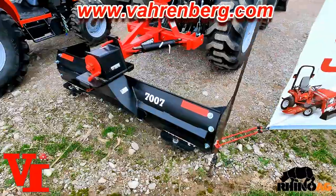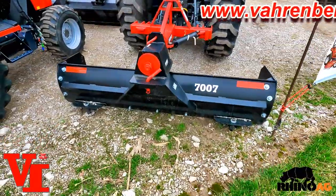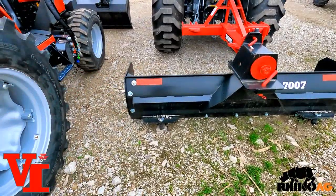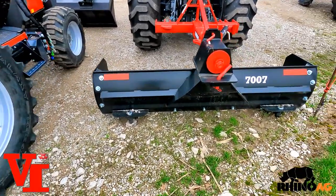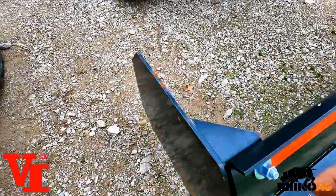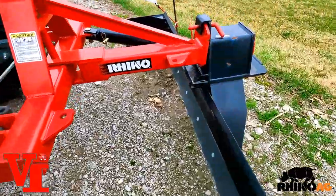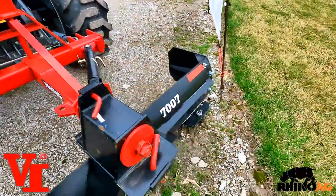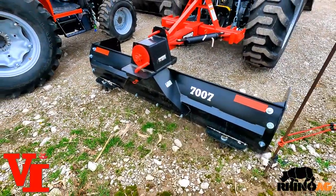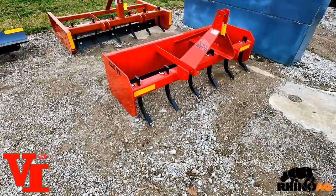This is a more advanced user tool versus the simpler tools I'll show you next. Over here on the 7007, there's an added feature addressing another disadvantage: most grader blades don't hold material — it can slide right off the end. But end plates bolt on and give you the ability to hold more material in the moldboard area of the grader blade. So for those two disadvantages, there are solutions available.